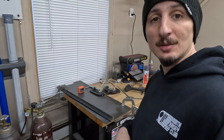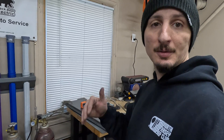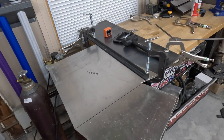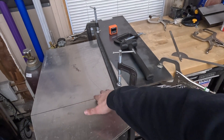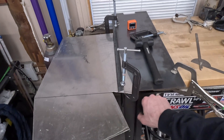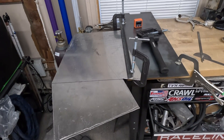For me it's nice and easy — I only have two bends and I know the angles I need. My suggestion is: whatever you're going to bend, make a cardboard template first, get your angles and measurements, and then come over and make your bends — because once you bend it you can't unbend it. Make sure your plate is clamped down to the table, and your angle iron is clamped down to the aluminum, the plate, and the table so nothing pops loose or impedes your bends.